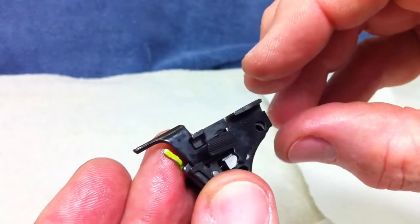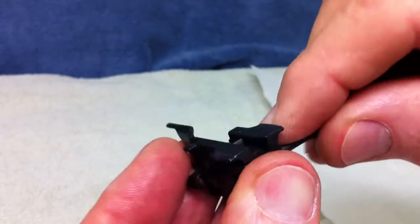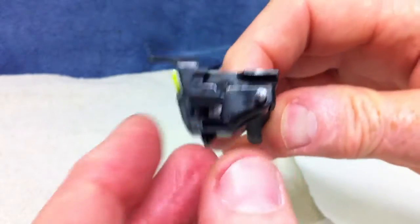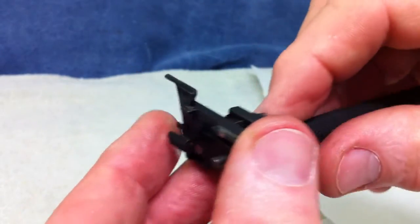It is best to have it in the down position — there is less pressure. If you put it in the up position it puts more pressure, so keep it in the down position. Get it lined up and make sure you can get that punch all the way through there — everything is lined up properly. You can see the punch going all the way through and the safety goes up and down — everything works.